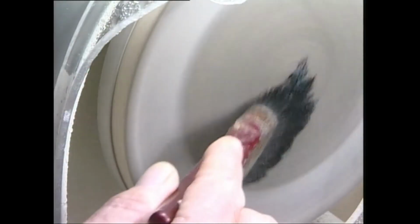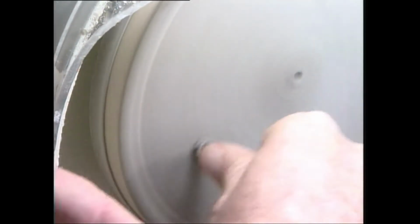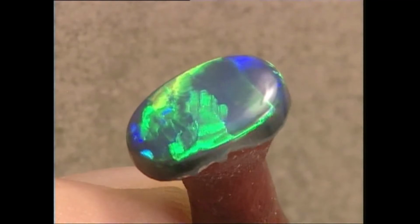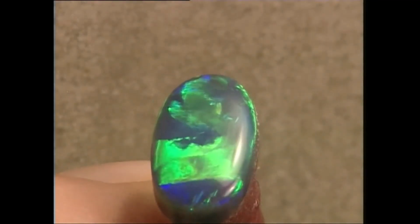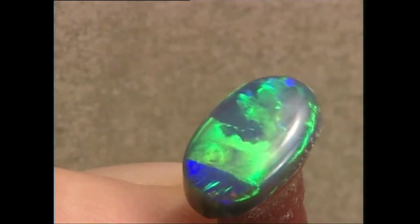Again, working its setting edge first, up over the shoulder to the face of the stone, spinning and oscillating at the same time, and maintaining a wet wheel. Felt does drag very much. If you let it go, if you let it dry, it'll drag badly, it'll burn stones very, very quickly. Spinning it up here. There's our stone pumiced. You see as the light runs around the stone, that's our indicator, and it shows us no rippling, no wheel marks, just a nice semi-gloss finish.